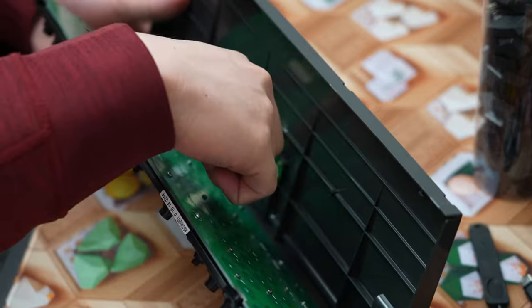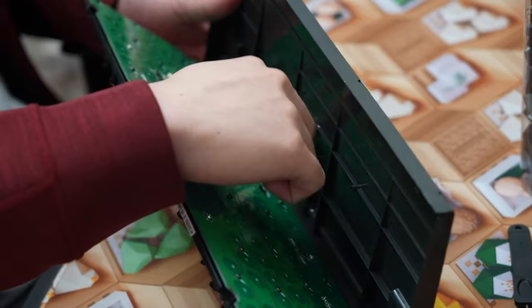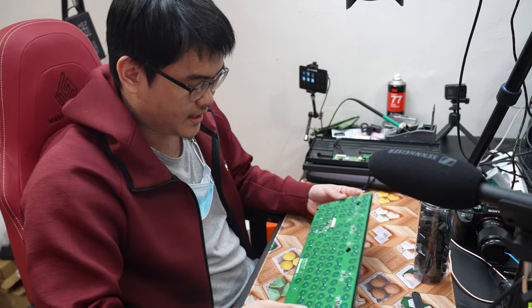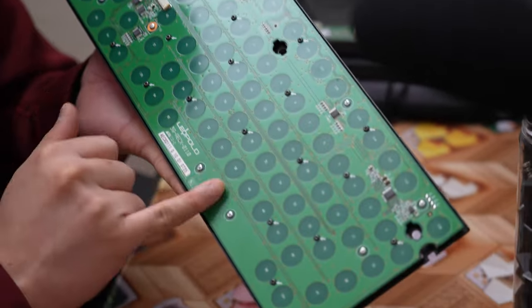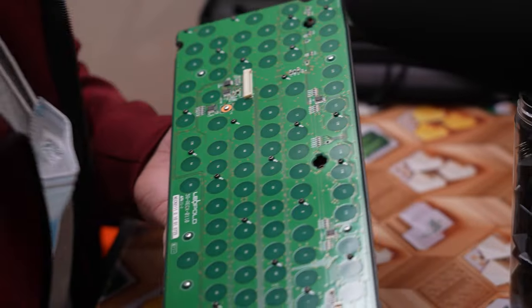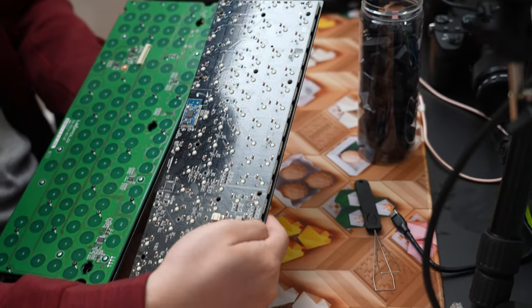This is the USB port itself — technically the motherboard — and there's a daughterboard which has everything, as well as another daughterboard. This is the bottom of a Topre assembly PCB. As you can see, there are no pins on the bottom, and none of the traces you see on a typical mechanical keyboard. For reference, here's what it looks like on an MX style regular mechanical keyboard.